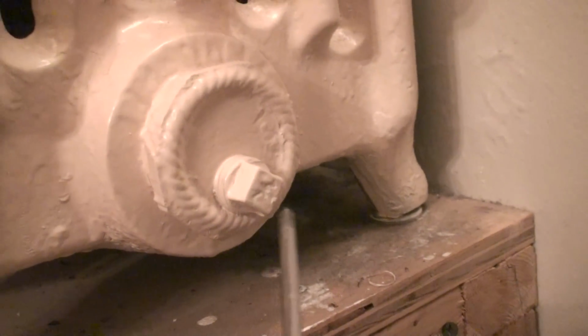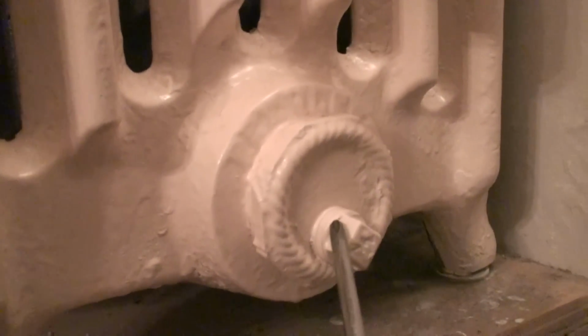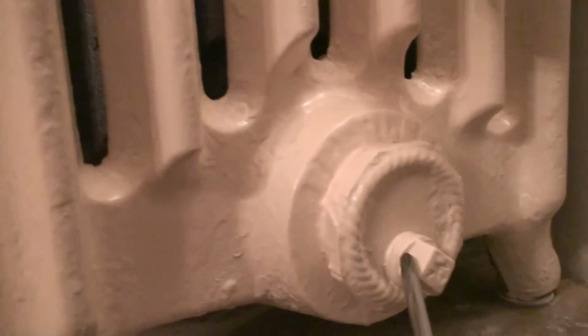The reason they made it like this is because they want to put the trap in there and get as much of the condensate water out of the radiator as possible and back into the return. A very brilliant strategy when it comes to a two-pipe steam system. The only problem is the setup. Once again, let's take all this other stuff, the air vent and the bushing up here, and remove it for a second.